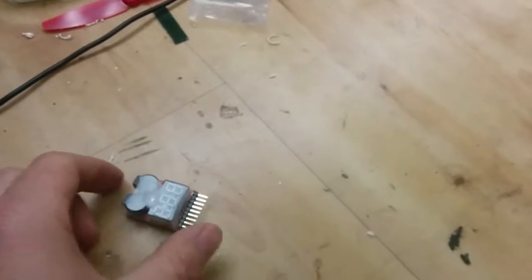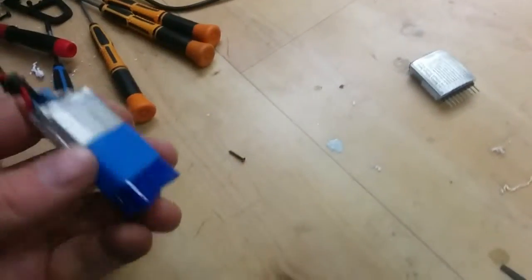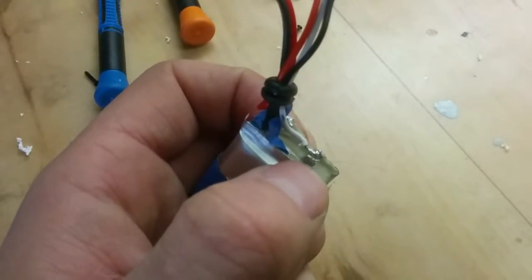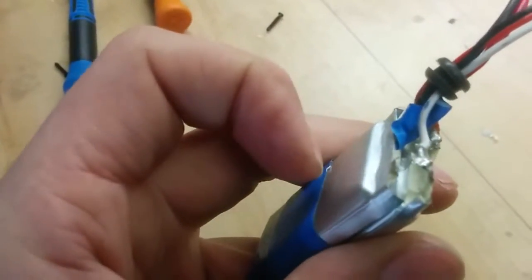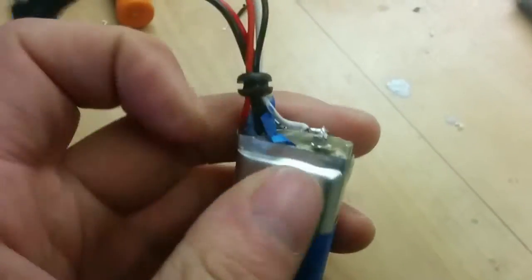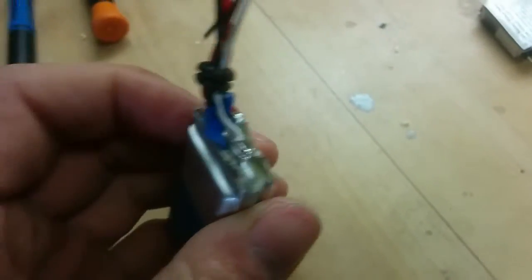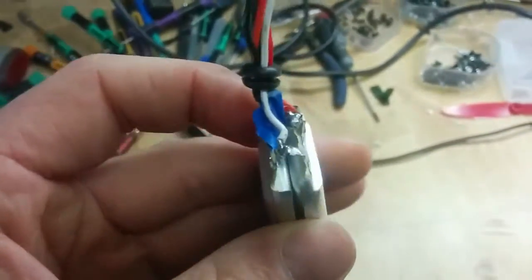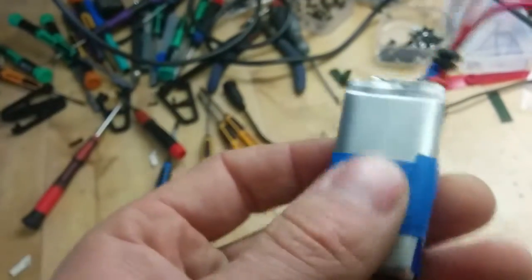Always have a beeper like this one on your battery. I also bought Fat Shark glasses. This is the battery that comes with it — it's second hand and it didn't work. This contact here was not properly joined; it was actually corroded away. I tried to fix it but I didn't manage to get anything on this tab. The protection circuit board — the electronic protection unit that prevents over-discharge — was also broken, so I had to remove that as well. The battery cells themselves are good, but at the moment it is put aside.